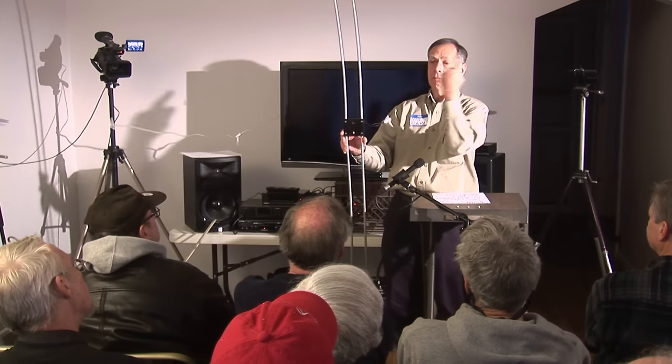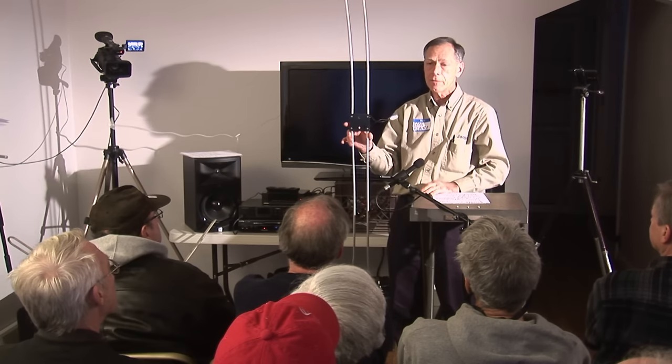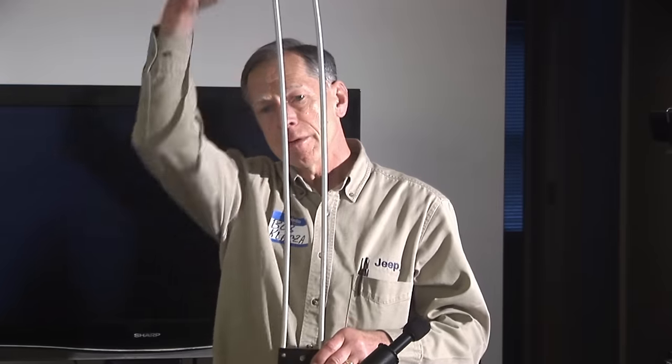This thing will pick up anything 360 degrees with equal intensity — equal ability to receive. It's like a car antenna. A car antenna placed in the middle of the roof has a ground plane that effectively doubles the signal capture for the quarter wavelength sticking above the roof. This dipole effectively doubles the wavelength, but without a big sheet metal ground plane. You hang this in the attic, run the lead down to the basement where your FM tuner is, and it works like a champ.